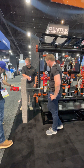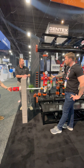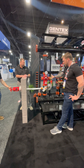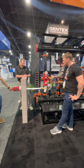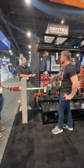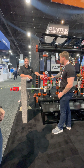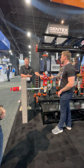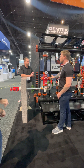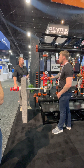That's an incredible innovation for the industry — something as simple as a product that's been around for a hundred years. Is this on the market now? It is. We've done the majority of common sizes: four, six, and eight. It is also sold with the UMC, so it can come as a complete package — you can order a wall post indicator valve and UMC valve together. It comes in normally open and normally closed valves; for your rooftop application you want it normally closed, and it comes set in the open or closed position.